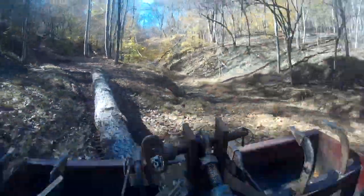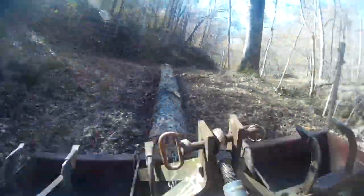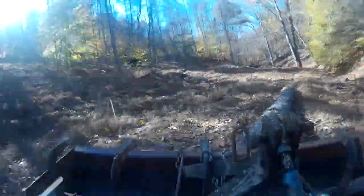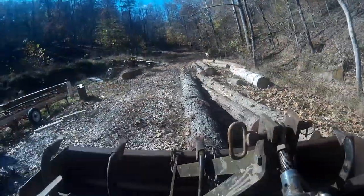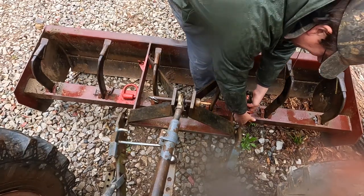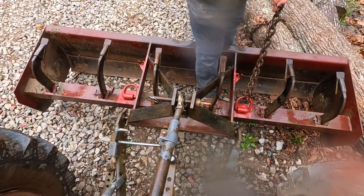Once you get that tree on the ground and cut into your first log, you've got to transport it from where it lays to the sawmill. That's going to require some basic tools like chains, tow straps, winches and cables — whatever fits best — and of course a piece of equipment to actually move it out of the woods and down to the mill. I like to have some chains, some cables, snatch blocks, pulleys, and those types of things. A chain and tow strap plus some cables will be very helpful. Also a cant hook or a peavey so you can move the log around to get your chain underneath it.